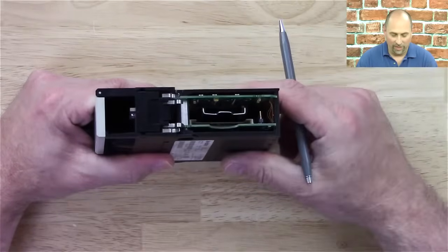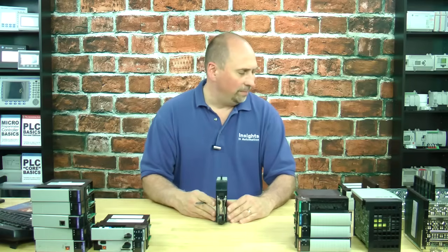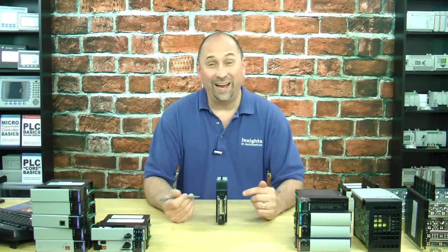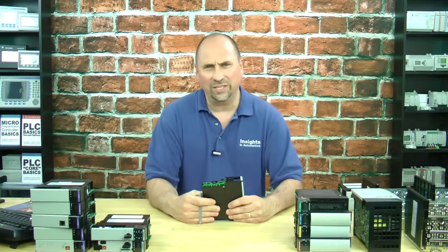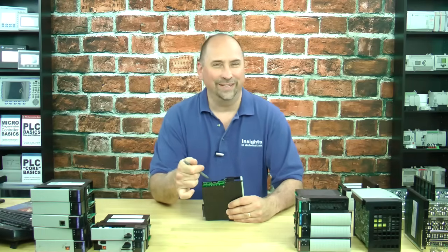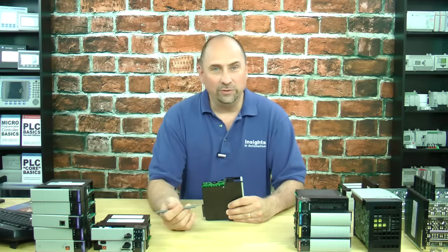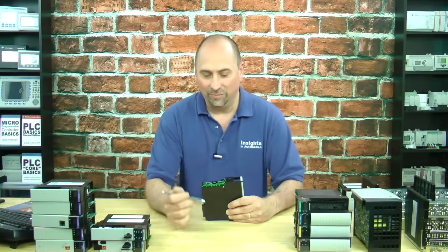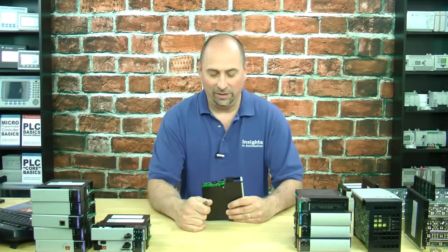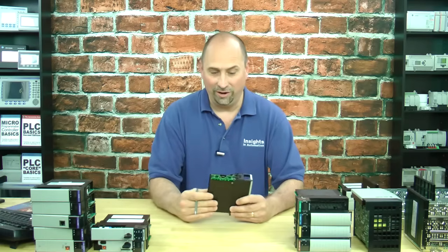That's where it goes right there. I just want to remind you that when you buy an L6, unlike the L55 or L1, you buy it at a particular memory size and that's it — you cannot expand the memory. You can add the non-volatile, but you cannot expand the memory. Back onto the compact flash: if you have a product line that makes hundreds of thousands of dollars an hour, don't go out and buy a $5 memory card as your mission-critical non-volatile memory. If you're only going to use it for testing or to transfer a program, an off-the-shelf card is fine. But if this is going to be on a mission-critical system, use an industrial compact flash card. It seems silly to buy a $4,000–$5,000 processor and then put a $5 card in it instead of a $100 card.